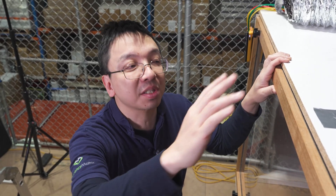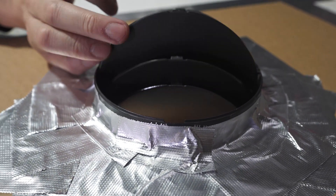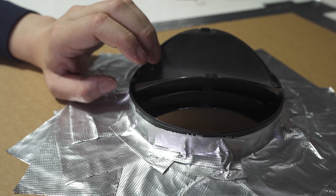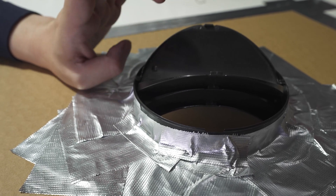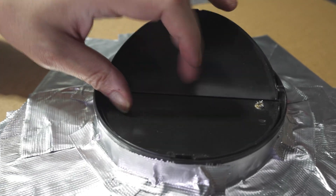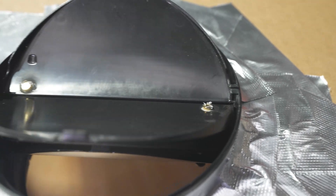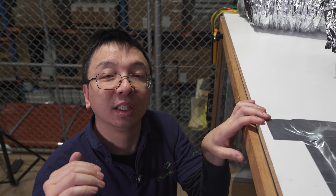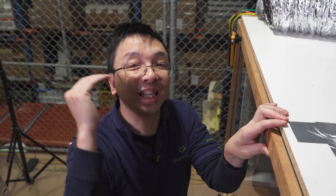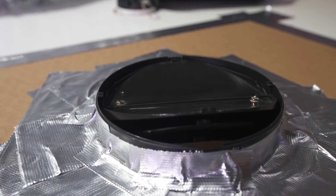Why is this Draftstopper so advanced? In this current setup we have three modules. The weight of each module increases the resistance to pressure. And if we look at the unit closer, you can see there are small magnets near the hinge. Those magnets create a sudden snap effect — when the magnet releases, the unit can easily go into a fully open position. That ensures that when you need the fan to exhaust, it can operate in an optimal, minimal-resistance manner.